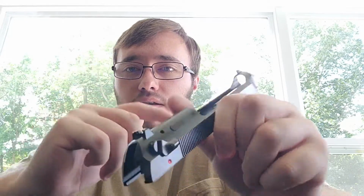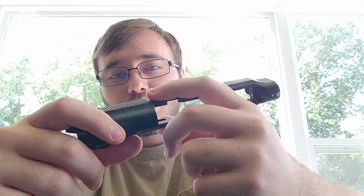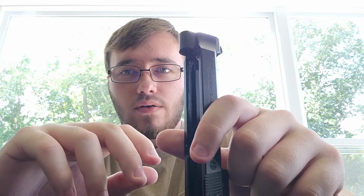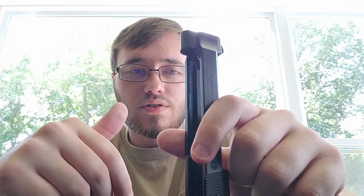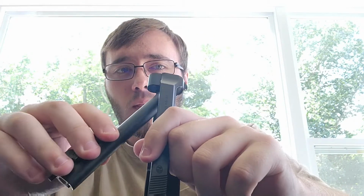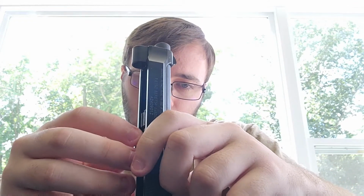I mean, if you wanted to wipe it down and stuff, like on the inside and wherever, and oil wherever, when you're oiling these, just oil just a little bit where metal touches metal, like the wearing pattern. Like if you shoot, metal touches metal, you want a little bit of oil there so then you don't have the excessive wearing and stuff. So then you don't have to replace them as much.